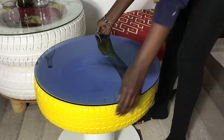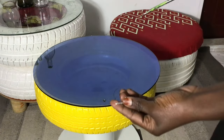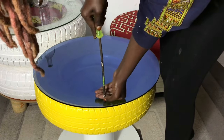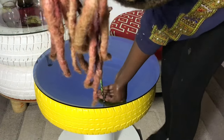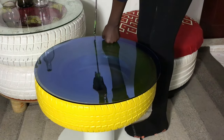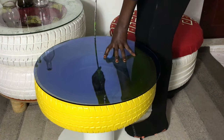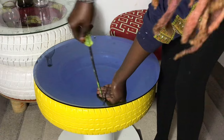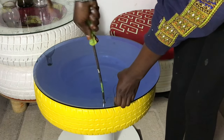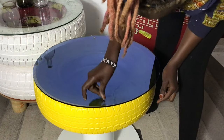I took my glass and put it back together. I cleaned my glass underneath so that it doesn't look messy. Now I'm using the glass screw and I'm going to tighten it using my hands — I'm not going to use the drill. The reason is that you need to be careful when it comes to glass. I'm putting my fingers underneath just to protect it. I usually do it halfway on both sides instead of finishing one screw at a time, just in case the other side is not aligned. When you screw your glass, do not put too much pressure on it — do not make it too tight. It's not good for the glass.